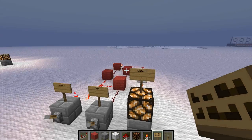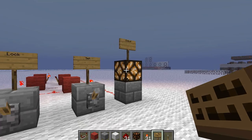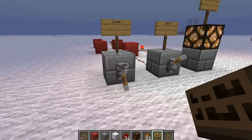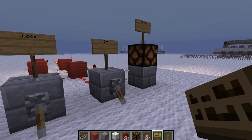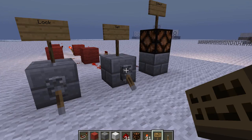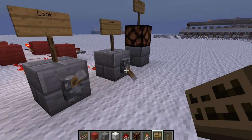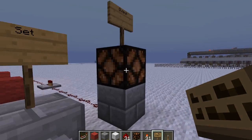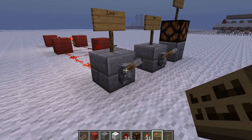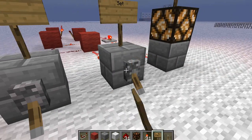This one of course is the output. The way this works is no matter what we do to this switch, it will not change the light — it will always stay on. If I unlock it, I can then change the state of the light, turn it off or on. But if I leave it in an off state and then lock it again, nothing I do here will change the state of the light until I unlock it. Once I unlock it, I can write to this bit of memory.